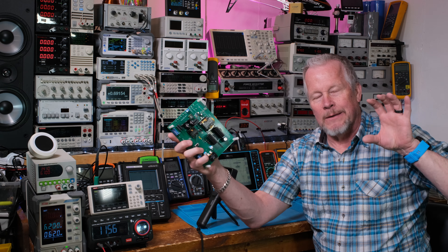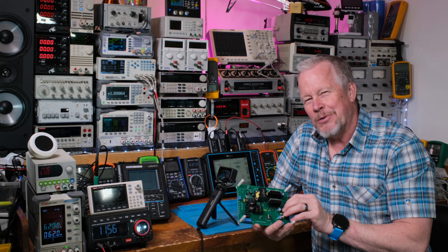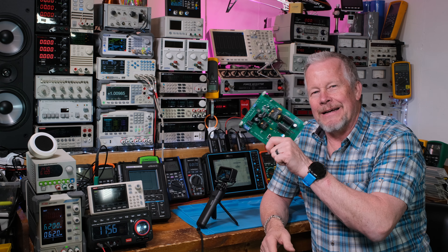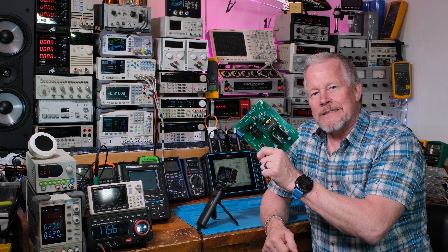The amazing thing with the LLC versus just LC is there are two inductors and a capacitor, so you get two resonant peaks with a band between them. Now you can be resonant across this band - pretty cool. Kiss Analog - I'll keep it simple.